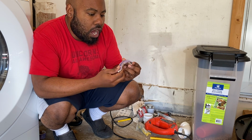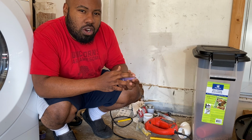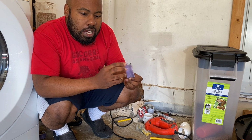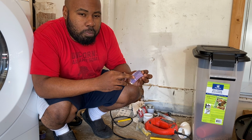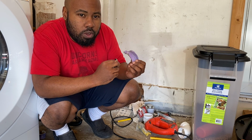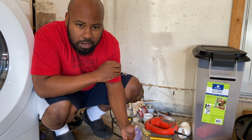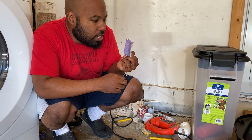It'll get nice and hot. But what that'll actually do is the cement behind there will start to warm up, and once it warms up the pipe, it'll warm it enough that you can pull that cement off and get a new piece of pipe in there. If you can hear that, that's still just hard PVC, because it went ahead and dried back out.